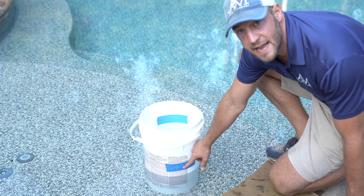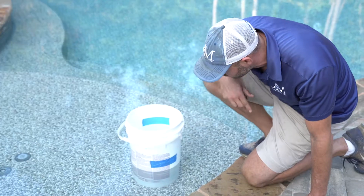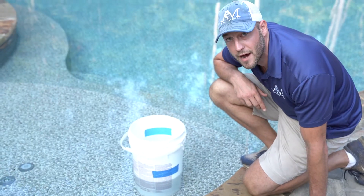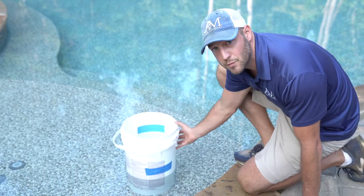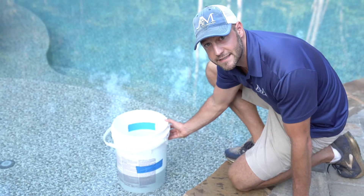And then I look down at the bottom tape, and looky there — I've lost almost an inch and a half of water on the bottom tape. So because they are different, I know I'm losing water in this pool and it's time for a leak detection.